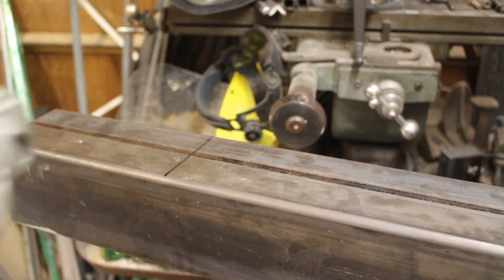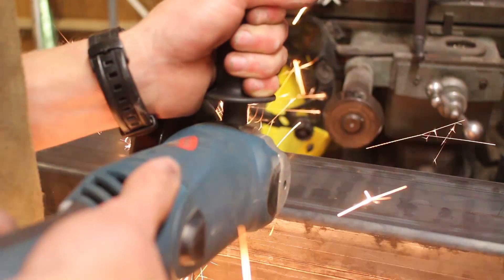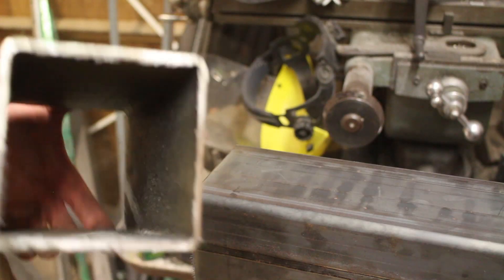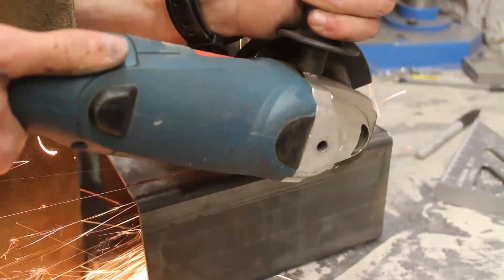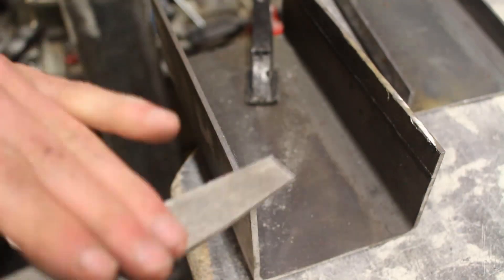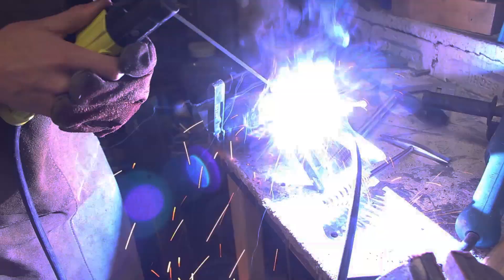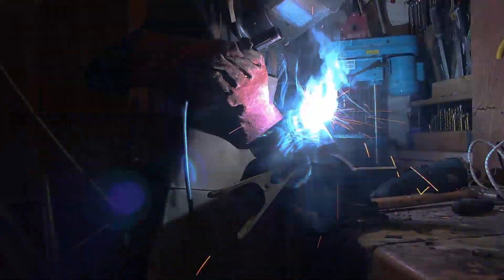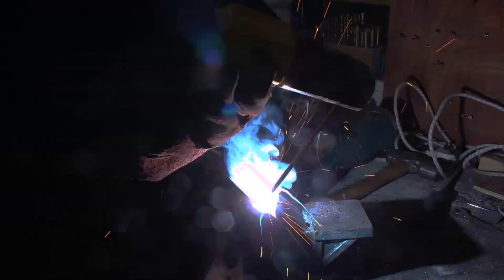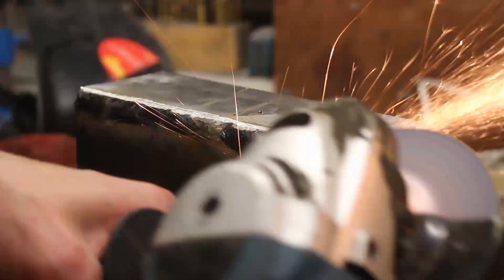I'm going to be making the electronics enclosure out of some 100mm by 100mm square steel tubing. The first thing I had to do was cut that to length using the angle grinder. I didn't actually need the box to be as wide as 100mm — I just needed it to be as tall as 100mm — so I used my angle grinder to split it right down the middle. This means when it's split I could put it back together with the pieces overlapping and weld it so it would be a rectangular piece, now only about 70mm wide. I ground down all of the weld seams and filed them over so they'd look a little bit better.